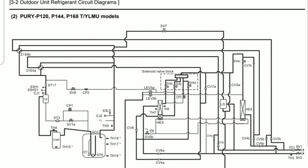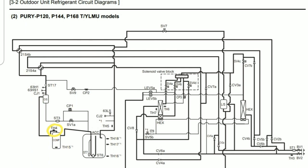If you're looking at a diagram, we are measuring our discharge temperature at TH4 on the compressor. I'm pretty sure that's the same on K's, J's, L's, and probably N's and all those generations. Changing the amount of refrigerant in the system while there's refrigerant in the accumulator has little effect on the discharge temperature. If you think the discharge is high because it needs more gas but there's liquid in the accumulator, you're not going to change anything — you're just adding more liquid, it's still boiling off at the same rate.